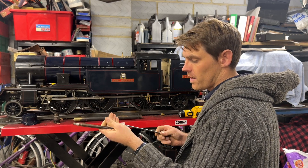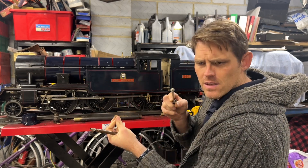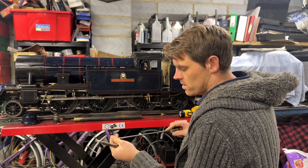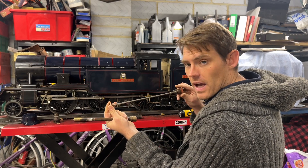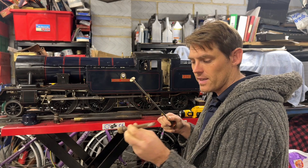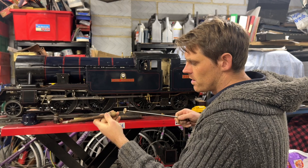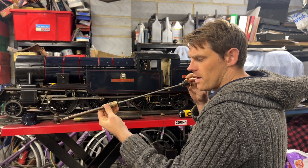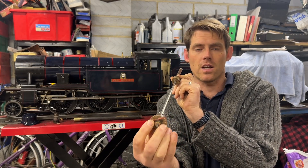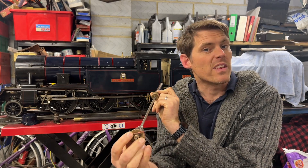The turning handle turns this little disc on the end of this shaft — there's a couple of pins going through and a slot. So as you turn the handle, you turn the disc. That disc sits against this block which is on the end of the steam pipe, locates with a pin in there. Turning handle turns the shaft, disc turns, opens the regulator — but the holes need to line up, and I can't quite see when they're lining up from where I am.